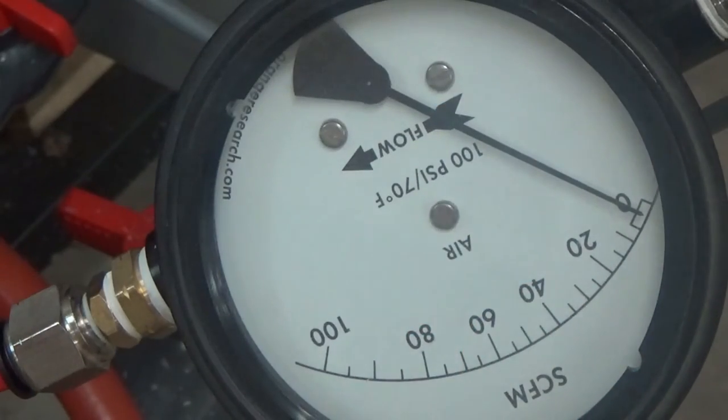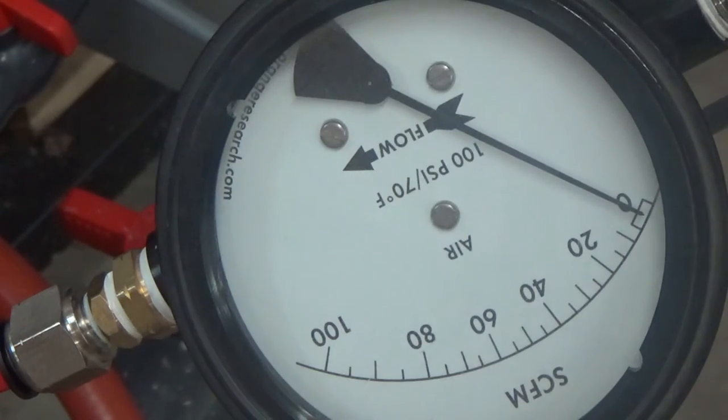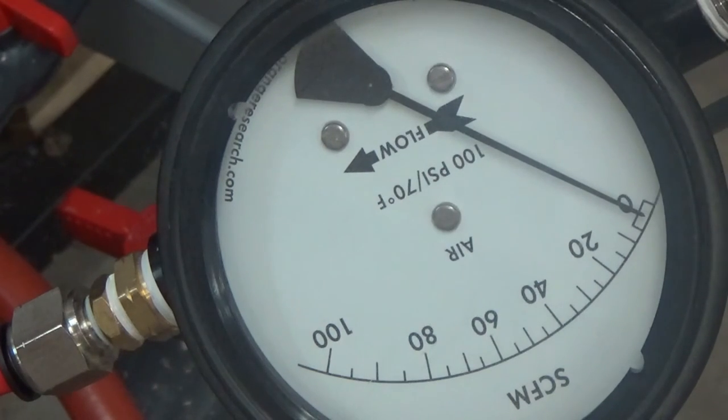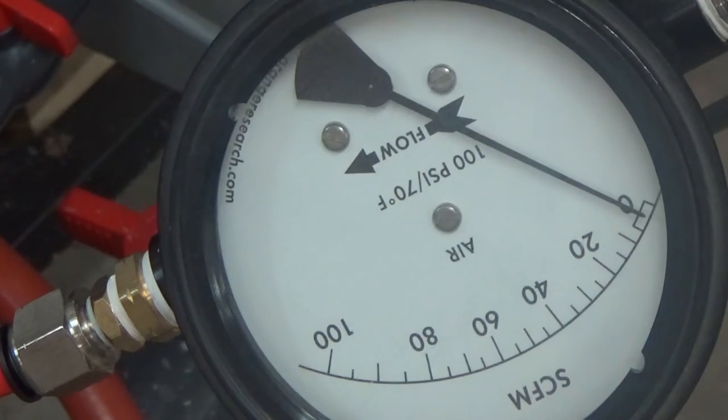Let's go ahead and take a look at the CFM gauge and see what CFM we're pulling on this particular VH800P. The gauge is upside down due to the directional flow of air, but we just flipped it for a quick and easy reading. We're set at 100 PSI static pressure on the main regulator coming into the machine. We're going to show you the working pressure, which is about 50 PSI, and the CFM — the volume of air needed to keep up those pressures. The needle is going to go to about 20 CFM; we're using approximately a 10 millimeter ID blasting tip.